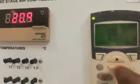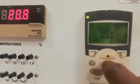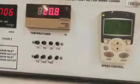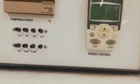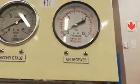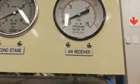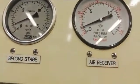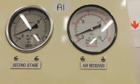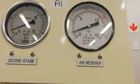If you don't want to run at the current RPMs, you adjust it using the up and down buttons. For this experiment, I will run it at 1,400. On the air receiver, you can see the pressure is starting to build up. Depending on what pressure you want to run it at, you wait for the pressure to build up until it gets to your desired working pressure.